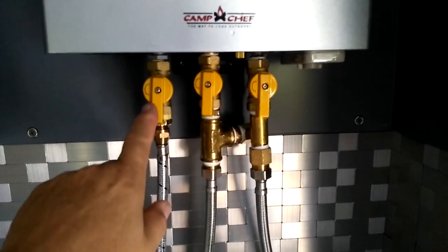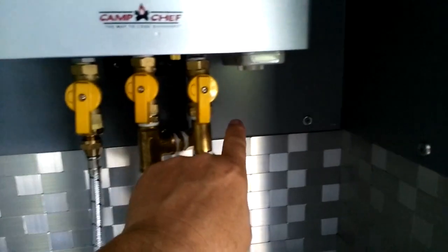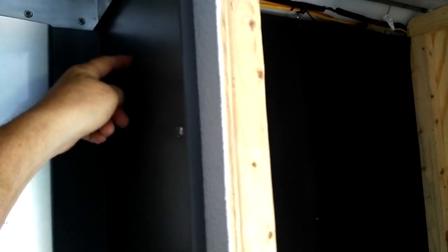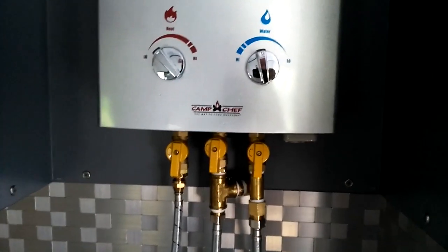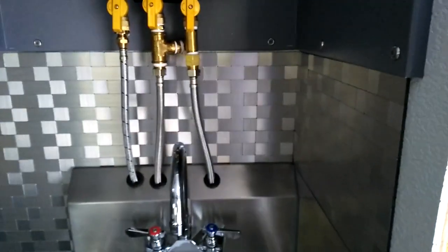What I've got here is the gas, the outlet, and the intake where the water comes in. But I have a fitting back here which is going to run across this wall, come out, and go up here and through here. My shower is right on the other side, so my shower spigot head will come right out this wall. All I have to do to get the right shower temperature is come over here and set these, just like I did for the sink. Then whenever I turn the shower head on, it will be preset so you can take a shower.